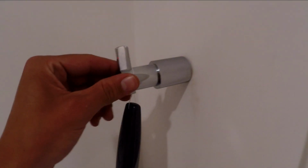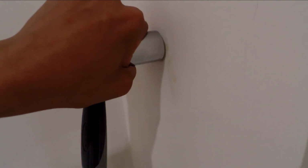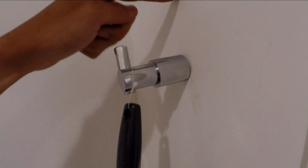And this is not, you can't stick it in the wall any better, so I'm gonna take it out, fill it, put it further up. But I didn't bring any plaster fixing stone from work, so I'll be doing that next week. Bits like this that need to be filled, all of the plastic caps and sockets all have paint on the side, so hence the scraper.